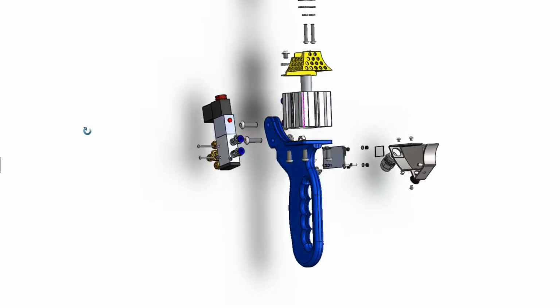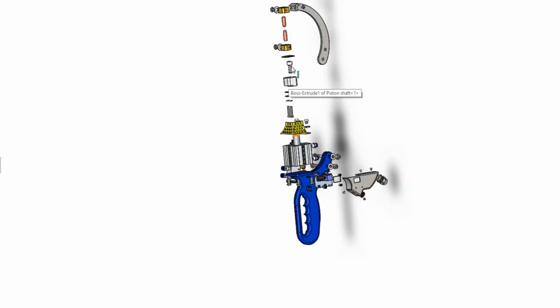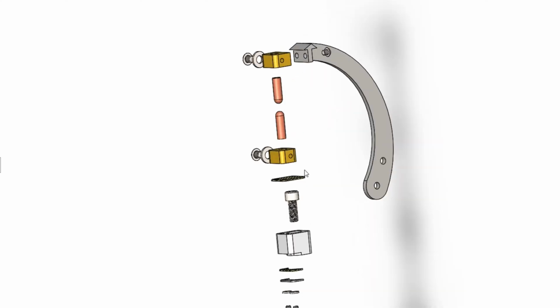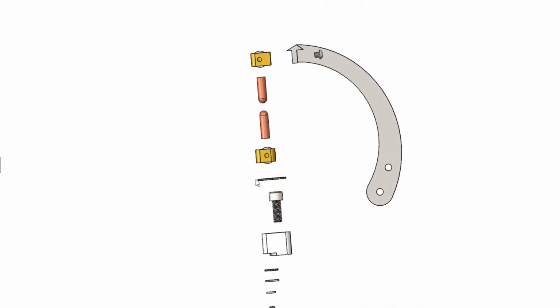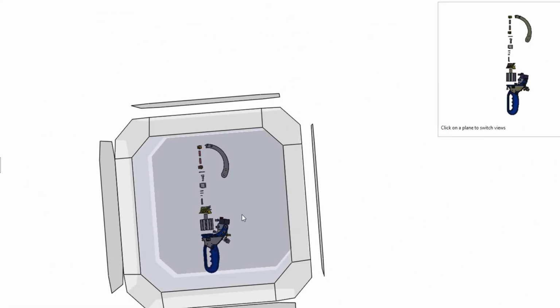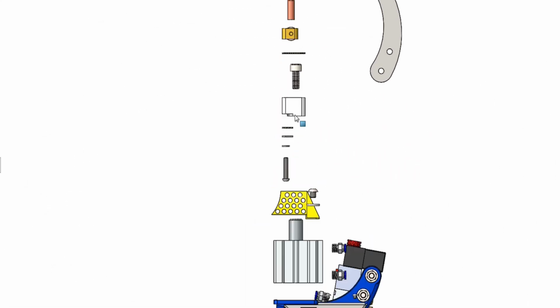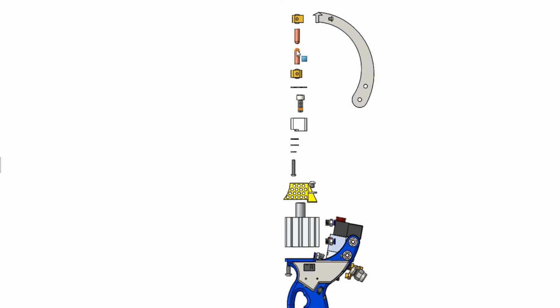So that's it. I think I've covered everything. Hopefully I haven't missed anything. It's very complex, there's a lot in it for what it is. And this part here took a wee bit of working out and measuring, because as you can see it's not center. I'll see if I can line it up here to show you guys. There we go. So there's the center of the piston, there's the center of the bolt, and there's where the electrode is. So the electrode's sitting off a wee bit.